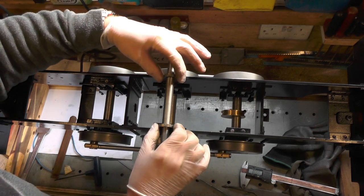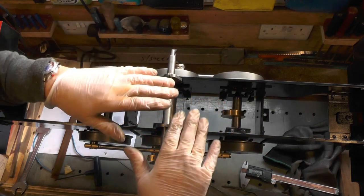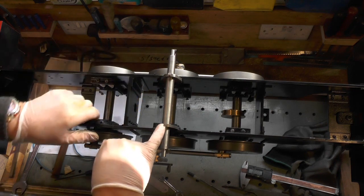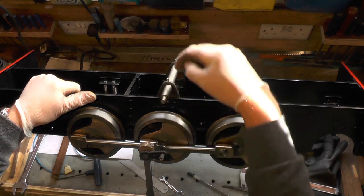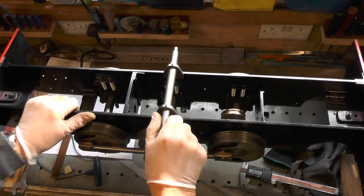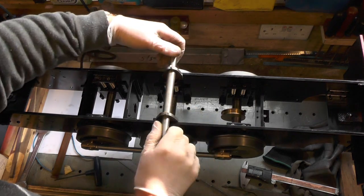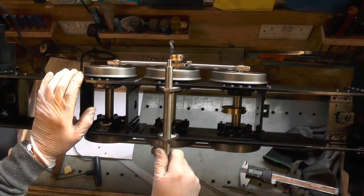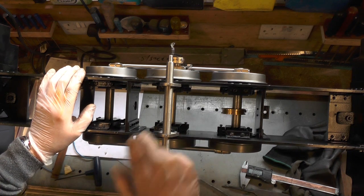Once your brackets are slid on, you can set the bottom of both brackets onto your drilling table and drill the 6BA screw holes in the top. They're going into a dimple in your tube that you drill and tap 6BA, and they locate the tubing solid in the frame. The alternative is to braze them on, but this method supersedes it - take your pick.